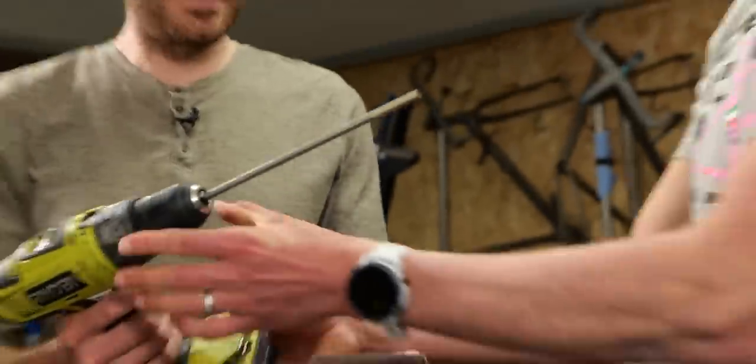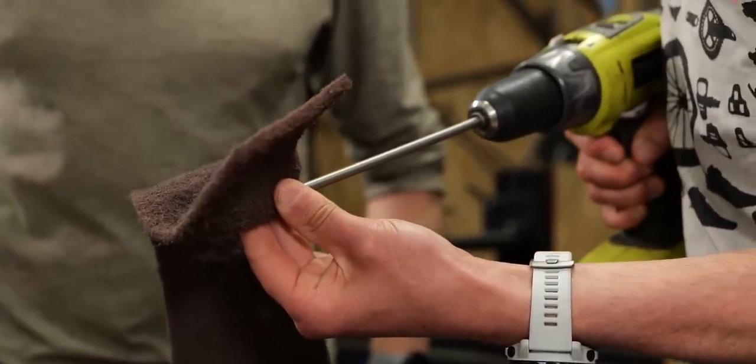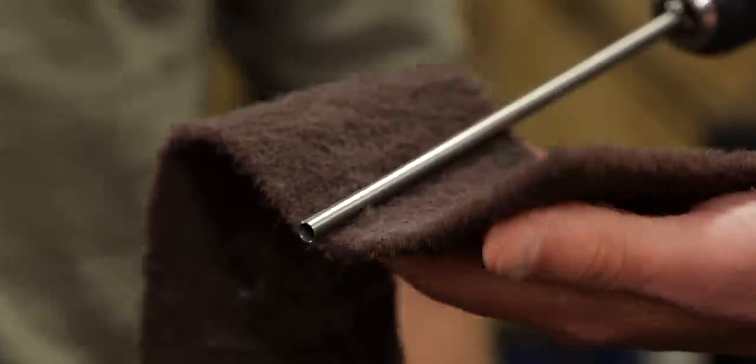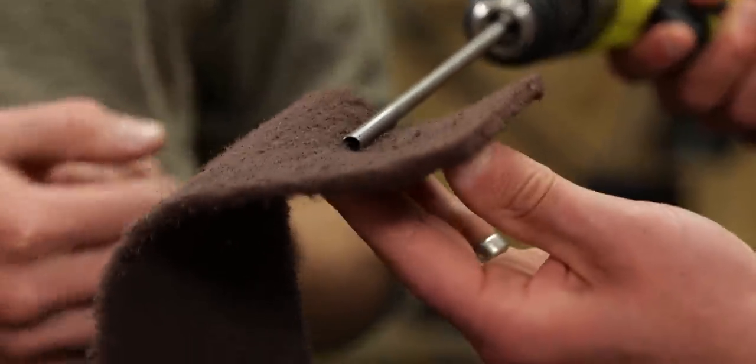These straws have got some anodizing on already, so we need to get that off first. This one's going to be quite easy because we can spin it in a drill. You want to spin it and hold some abrasive on it. It comes off quite quickly — you can see it got through that oxide layer and got back to the bare metal. We're not adding a dye; the color you see is just the result of light reflecting through the oxide layer. That means it is quite sensitive to the surface finish of the metal — any inconsistency in the surface finish, you'll see it. Carry on a bit more and brighten up a little bit more of the tube.